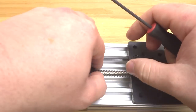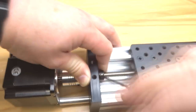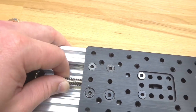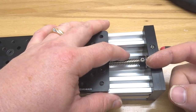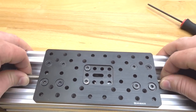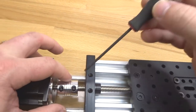With the bottom portion locked in, work your way to the top portion — same thing: put pressure on the lock collar and tighten it down. Test the lead screw by pulling side to side to check for play. There should be no play; if there is, reevaluate tightening your lock collar. You may need to adjust the angle of tightening since the threads are pitched — sometimes tilting the lock collar slightly gets a proper lock. Now tighten the flexible coupling set screw to the lead screw, rotate, and tighten the additional screw.